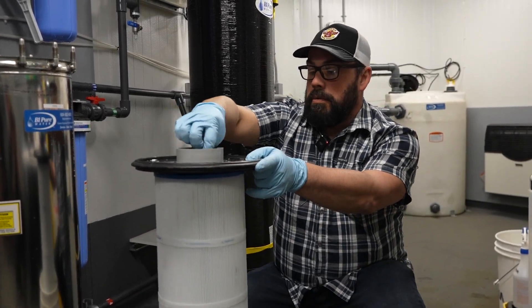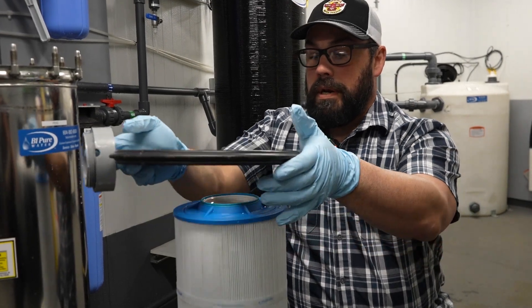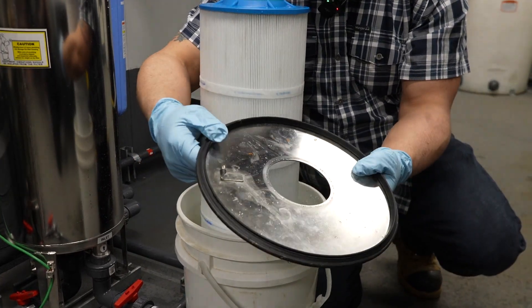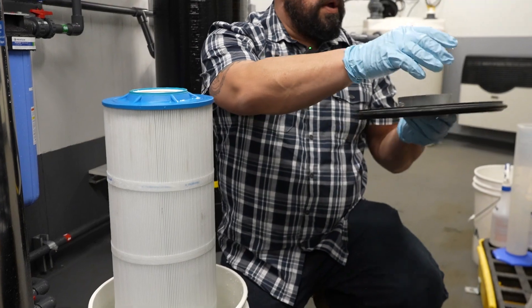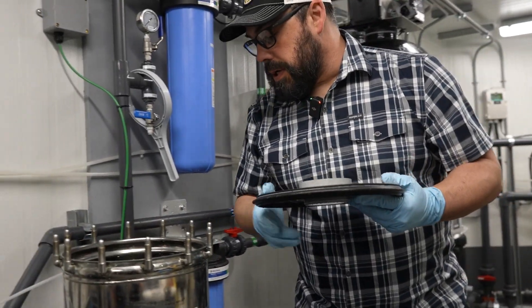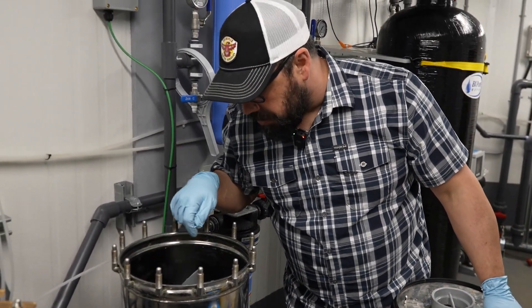To carry on, we remove the threaded cap off the top, pull it off, take your lid off, inspect the bottom, check your o-ring, make sure there's no cracks, damages, or any other potential cap contamination. You take your lid and your cap and wash them in the sink under open water. Then look inside, get your shop vac, and vacuum out any particulate that may be stuck on the bottom.